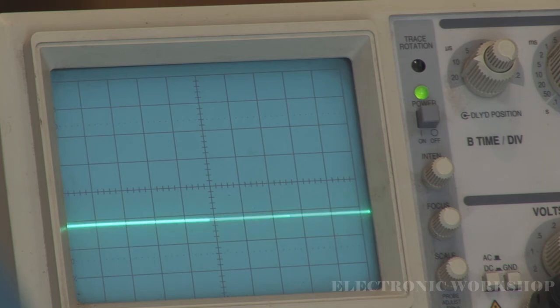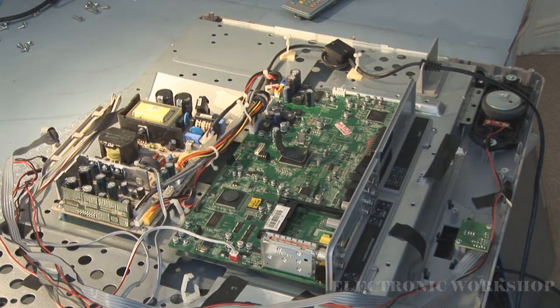What I'm going to do next is take all this off and have a look at the LVDS cable connector that goes up into the back of the screen — first to make sure it's not dirty, because a dirty connector could cause you to lose one of the five-volt or three-volt supplies to the actual logic control board. The other possibility is a chip on the control board with a dry joint. That's my next step — I'll take the screen apart and have a look.